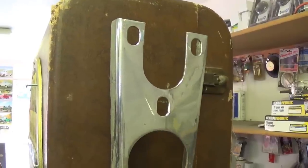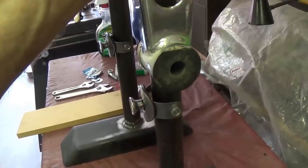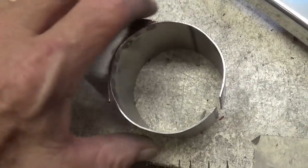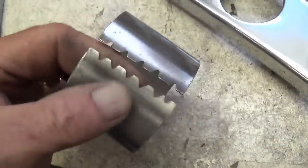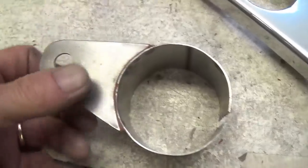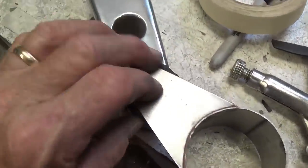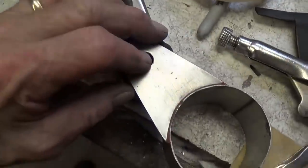Now it's time to make a matching shoulder, install the arm, and create a little gripping hand for the left arm. I'm working on the left hand of the robot — it's sort of a hand like a steam shovel with jaws that have notches. Then this will be the wrist piece, just a piece of steel that's been radiused to match the jaw. All of this will fit down here and bolt through to make a wrist on the left arm of the robot.